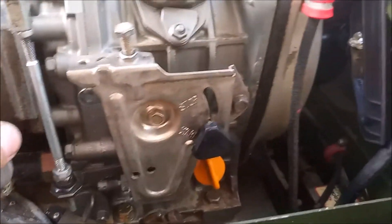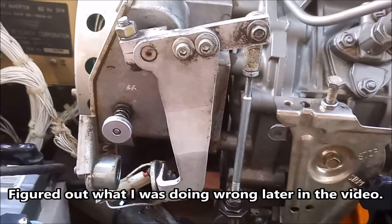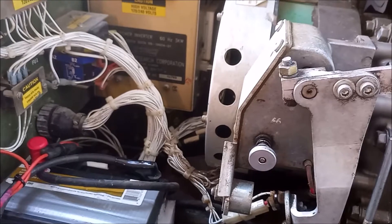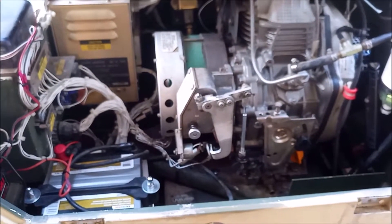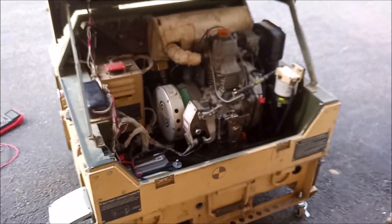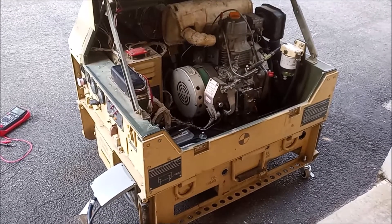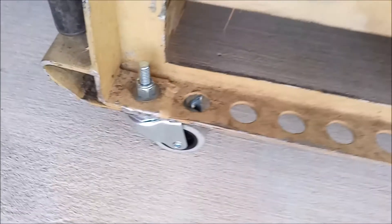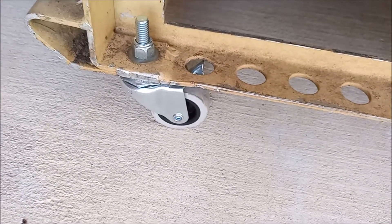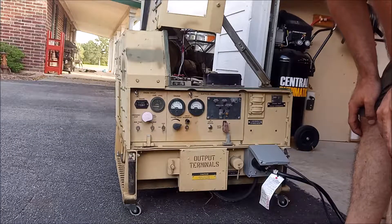I tinkered a whole bunch more with the governor and measurements and I think I got myself pretty close. I'm still having a little bit of issue with the pull start — the engine runs but it's got some issues and you actually have to trick it by shutting it down and moving it back to run position, and then it clears the problem. I load tested it all the way up to 3,673 watts and it will carry that load. I also put four caster wheels on here — just the smallest ones from Home Depot. One issue I noticed is that in the South Texas heat, if you leave it outside on my asphalt driveway it actually sinks in a little bit, with all that weight on just those four small points.